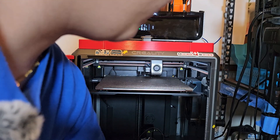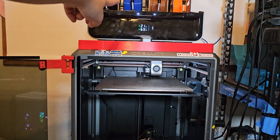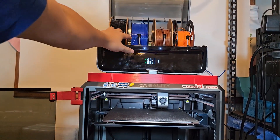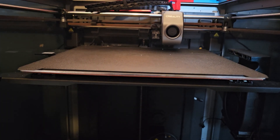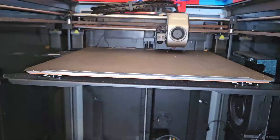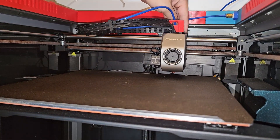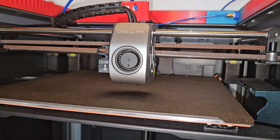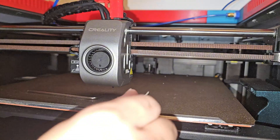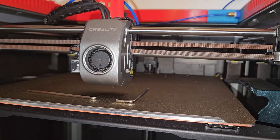What I'm going to do is use the third slot. I'm going to select the screen and click extrude for the third slot — and look at that, it retracts the second slot for no reason. This second slot is so cursed. If you've been following the channel, you've seen I've taken off the K1 Max tons of times, but I'll still show you how to do it in this video. Before I take off any screw, I'm going to disconnect this tube right here. We're going to look down there to see if there's any filament.